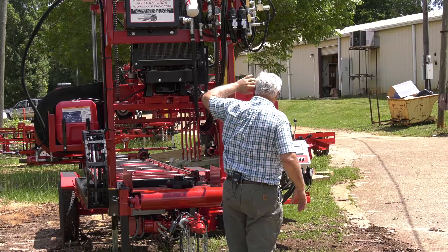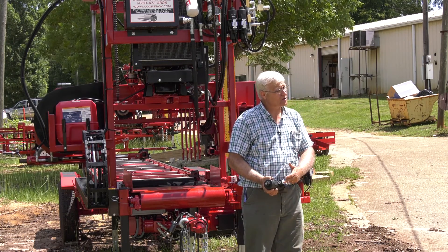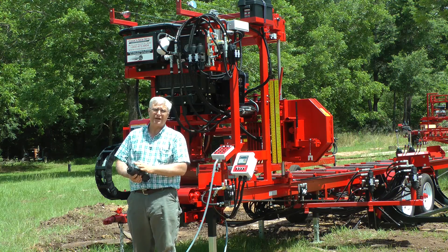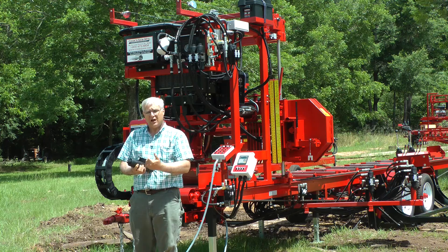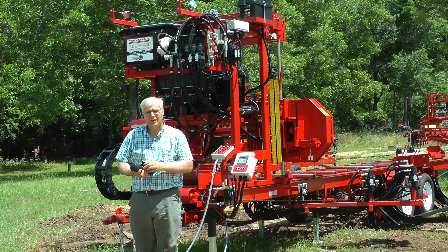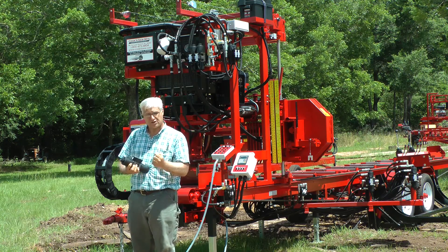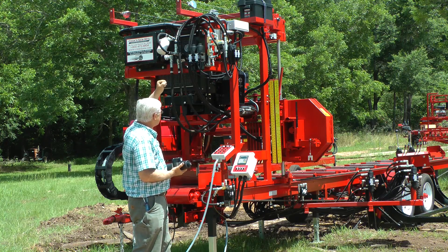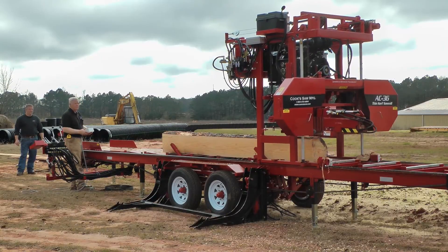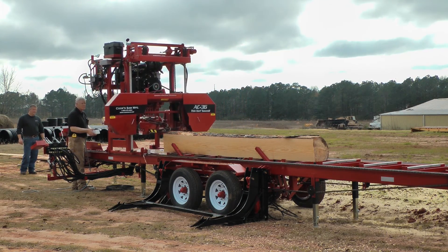Our valves — we've got two right here with others around the machine. These are called a DO5 valve, which is a larger valve. There's a diagram schematic of what they do. We use what's called a tandem, sometimes called a closed center, because when it springs to center it's closed off and it holds something in place. Essentially, in some places we want to hold something in place — when our head is all the way up we've got a hydraulic motor driving that, and when it stops the gearbox holds it, but we also have it in closed center so no hydraulics are moving or leaking.